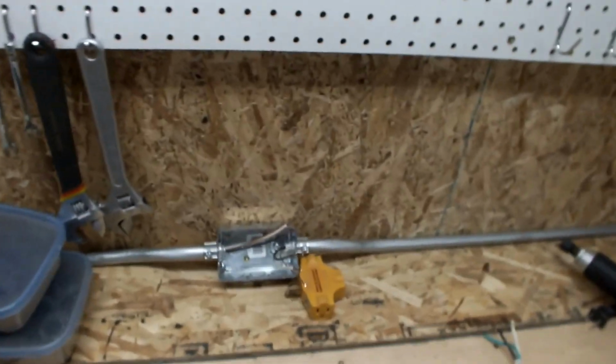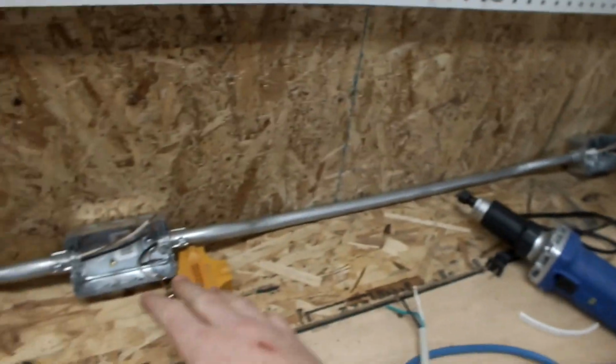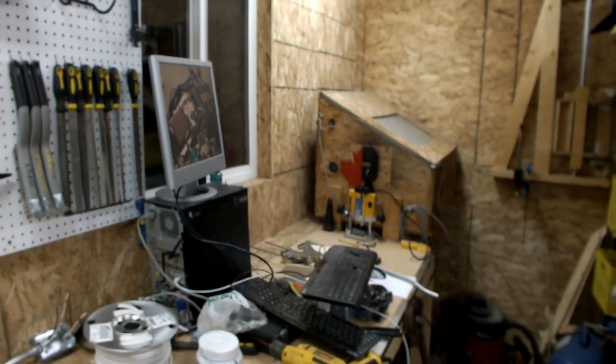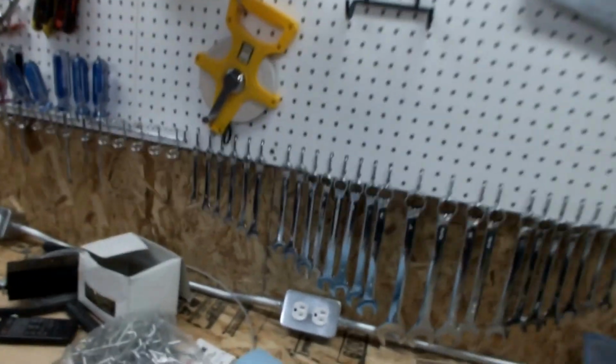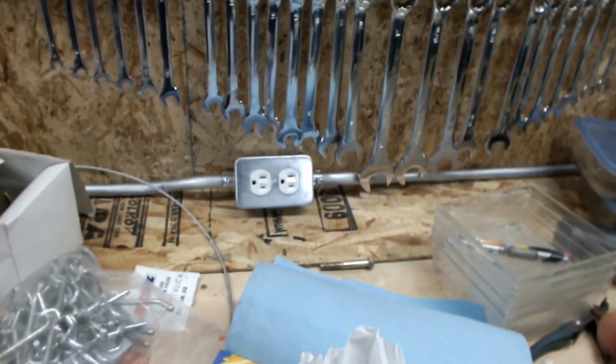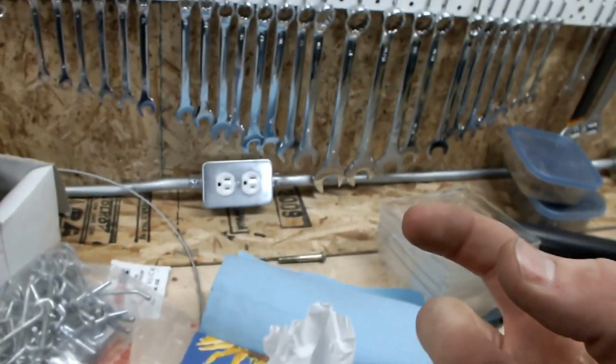So these outlets on the top of the bench will be 1 circuit. I've got those ones wired in, and then I have these 2 pulled through, and I'm working on putting the last one at the end of the run there. The orientation for outlets, there is no real code for the orientation. You can put it whatever you want so long as you're consistent.